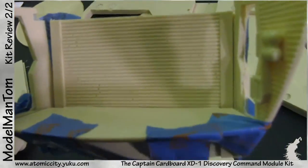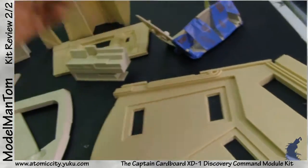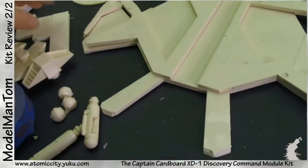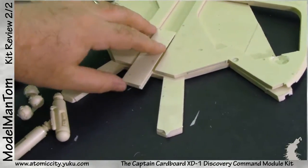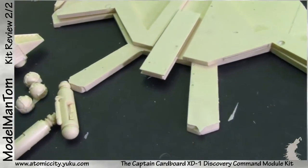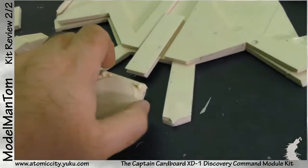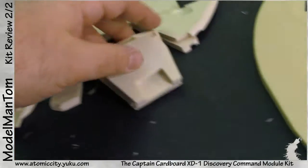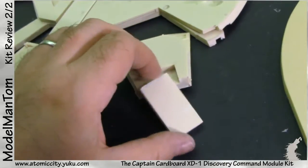There are a bunch of little pinholes all over this piece, but given that it's going to be painted black and in shadow, it's probably not going to be seen at all. This center track here is for the extending pod rail. The idea is that you take two pieces of brass and slide them in the side there, and then to the center pad you drill a couple holes, and you can pull this in and out — that will be the track for it. The other two pads have these holes back here which fit these little slabs.